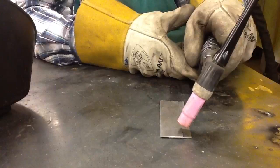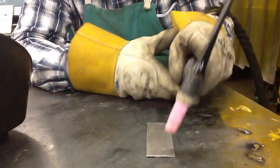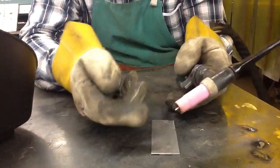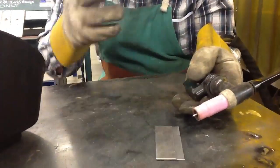My heat is going to be going right into this lap weld, and I'm just going to work this back and forth and weld this joint together. I might spot this side, stop, dial this up, spot the other side, because otherwise I know it's going to warp apart. What we're going to ask you to do is just a simple lap weld like this without filler rod to start with. And we're going to try to actually record this right now using a screen on the welder, so it's going to go dark for a little bit.